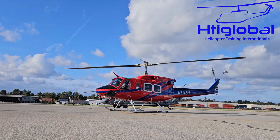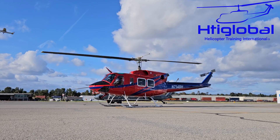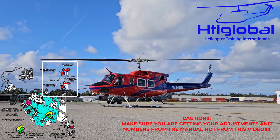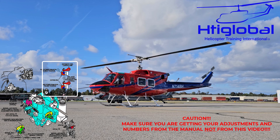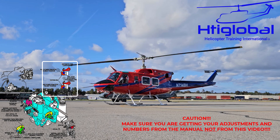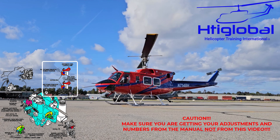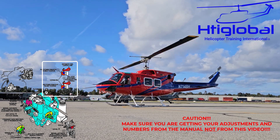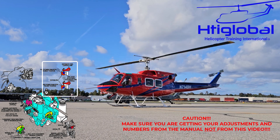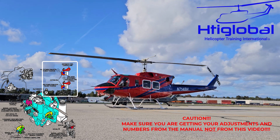Note that you will need to be sure which tool you are using and what engine and helicopter you are doing topping on. With this in mind, as a reference from the maintenance manual, you will find the following: the check fitting falls within the following range — on PT6 T-3 engines, 96.1 to 97.1 with part power trim stop; on PT6 T-3B dash 3BF and PT6 T-3B dash 3BG engines, 99.8 to 100.8 with part power trim stop.